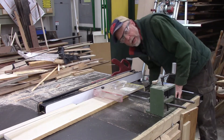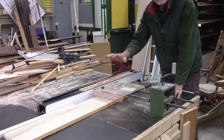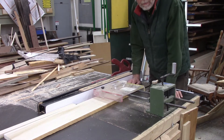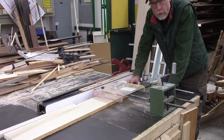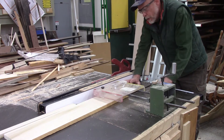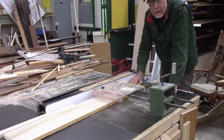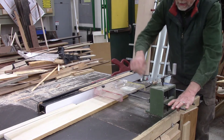When I finish using a table saw and I'm ready to walk away, the last thing the manufacturer asks me to do is lower the blade down. I turn the handle in the front to drop the blade below the surface of the table, so that someone's hand can't accidentally get into the spinning blade, which is coasting to a stop. One of the problems with all these machines is that once you turn them off, the blades or belts continue to coast, so I always want to take precautions to make sure that the coasting blade does not get into my hand or a piece of wood.